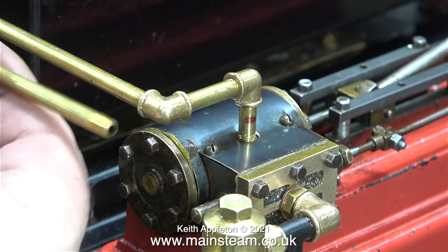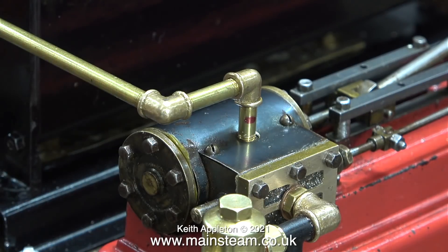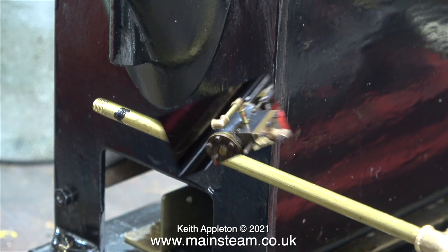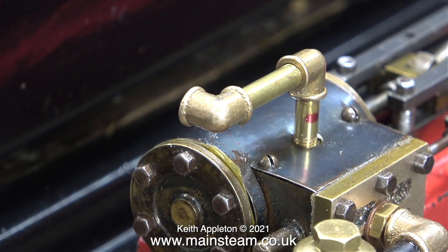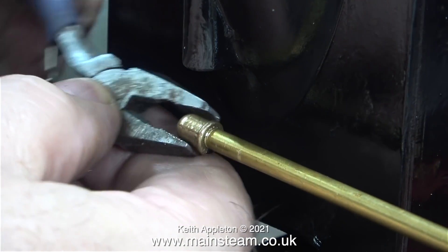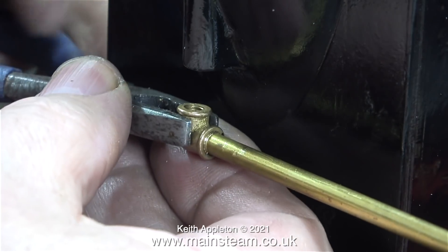All is not lost — there's a simple way around this that I'll show later in the video. I need to find a piece of PM research piping long enough to go from the steam engine to directly underneath the hole in the boiler's end plate casting that supports the chimney. Here I've marked the position where I need to cut it. The length needs to be a bit longer than you'd think to accommodate the threads I'm going to cut on it in the lathe — a very simple job using the chuck and a tailstock die holder to thread a short length at the end, 3/16 by 40 threads per inch.